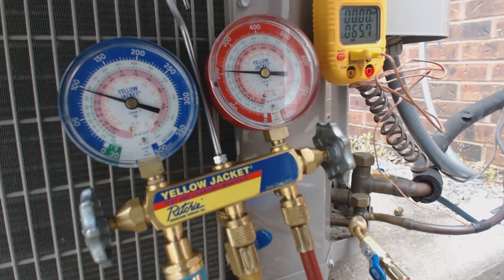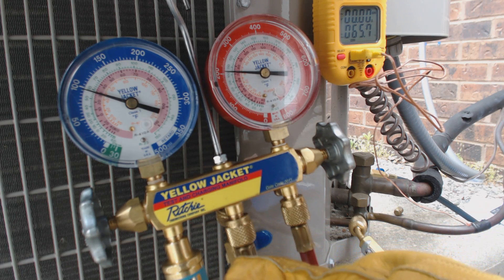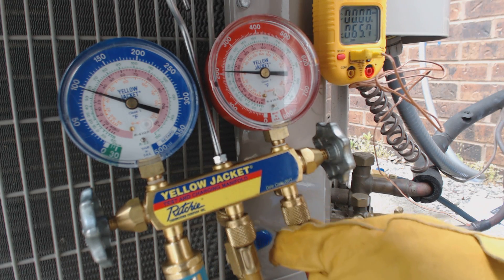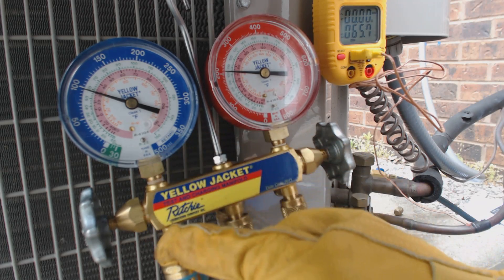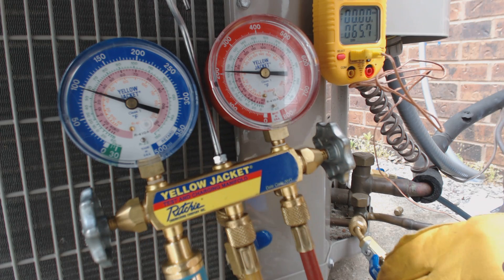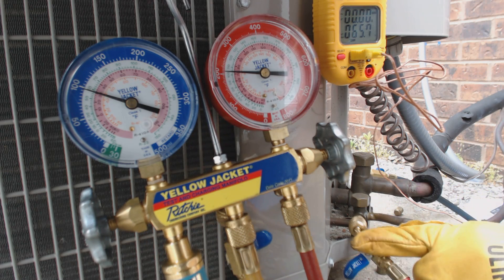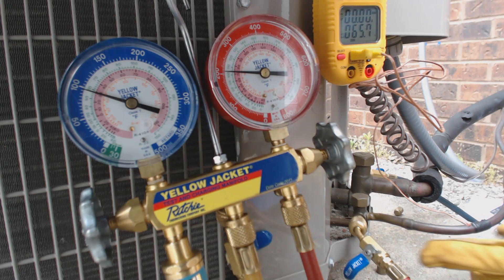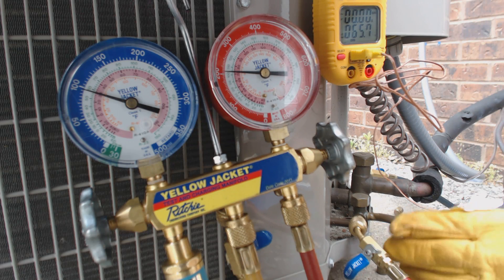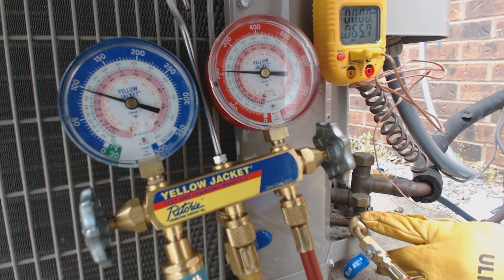After checking the charge and it's good, and say you did not put any refrigerant into the yellow line, what we can do is charge liquid from this line into your service line and dump it back into your vapor. The way we do that is we disconnect from the liquid line first, so we're going to turn that valve off. You should have a manual valve on your hose set or a quick disconnect head — they're both low-loss fittings.